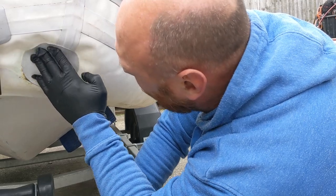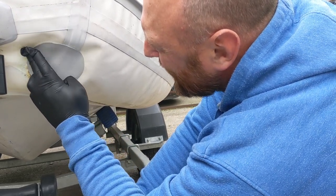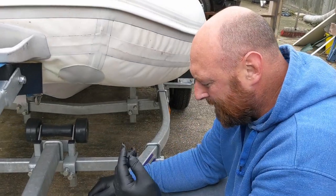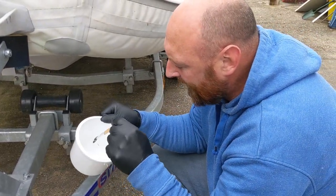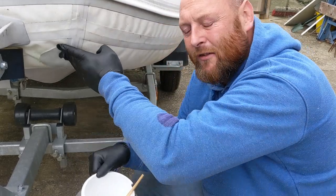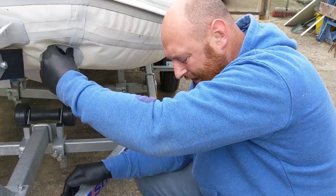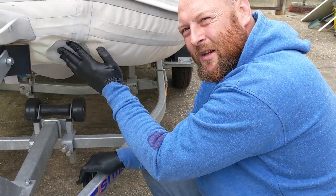As you can see, some air has escaped from the ribs so I can push the patch easier. I don't want too much air pressure pushing through, so as long as I can get my fingers around and keep this edge sticking and well adhered. I've been working at this for about four to five minutes. People always wonder when to stop — how do you know when the glue is set enough to leave it? One way to tell is to look at the leftover glue in your pot. If it's still goopy and usable, the glue under the patch can't be dried enough either. This glue doesn't dry through air — it cures through the hardener via a chemical reaction. So even if it looks dried around the edges, the glue inside is not set. Keep working until the glue in your pot is set, and then you know you can leave it.